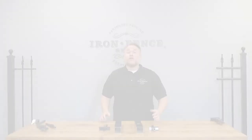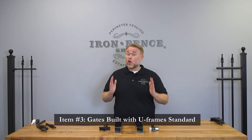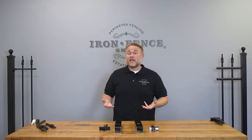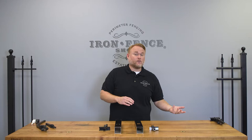The third item that makes our Infinity aluminum fence better than the competition is we build both our pedestrian and driveway gates with U-frames standard. The U-frames we use around our gate go a long way in making a stronger and sag-proof gate. Unlike a fence panel that remains stationary and doesn't have a lot of force put on it, gates see all sorts of leverage forces. Even when hanging closed, the gate is being held by the hinges on one side with more force being exerted on the frame. When you open the gate, you also have the opening motion as well as any force being put on the gate transfer to the entire piece. Throw in slipping and grabbing the gate, putting a ton of force on it, or kids hopping on the end of it for a ride, and the strength of that gate frame becomes very important. Let's go grab a few pieces from the shop to show visually why that U-frame matters.